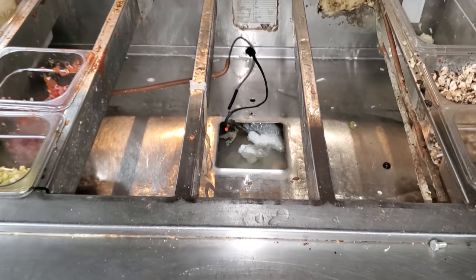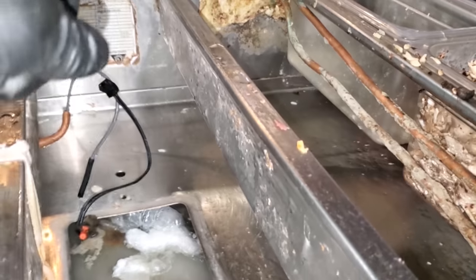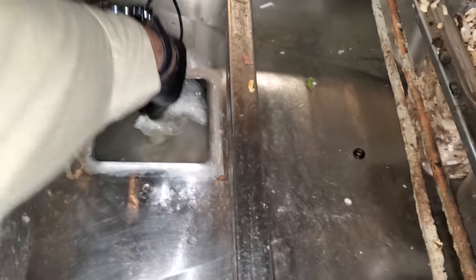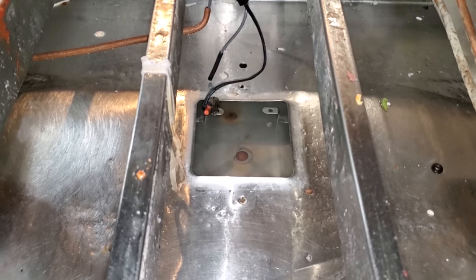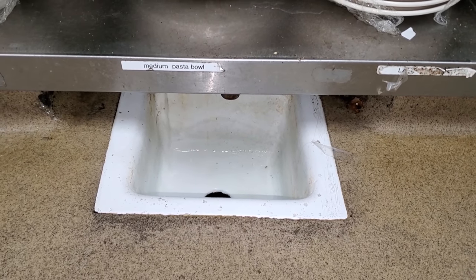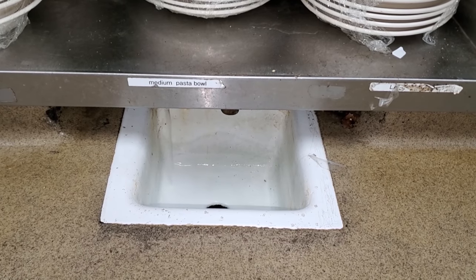You'll see the crap flying out of that drain. They really opened that unit up — I'm assuming there was a leak and someone cut the unit up, but that wasn't me. I let it sit for a little while — this one's not horrendous, so we'll go ahead and pull the drain. Watch out, this is bleach water so you don't want to get it on your clothes. If you do this often it won't be as bad, but if you don't, it fills up nasty. The flow is increasingly larger — it's been breaking up stuff in the drain lines. You've got to be careful because these are common drains, so if the drain's plugged up it could be overflowing bleach water inside the box.